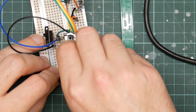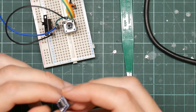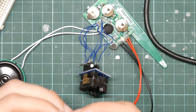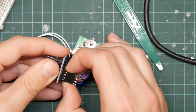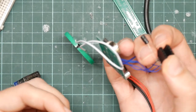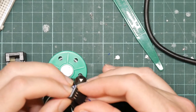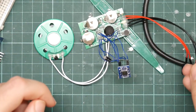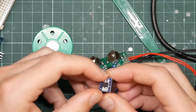Okay. So now we should have a nice DIP adapter containing a 2 megabyte flash chip. So let's get this thing out. Pin one is there. So we remove the ZIF socket. Now it goes this way up. Like so. Does it play back? No, it does not. That could be because it's backwards.